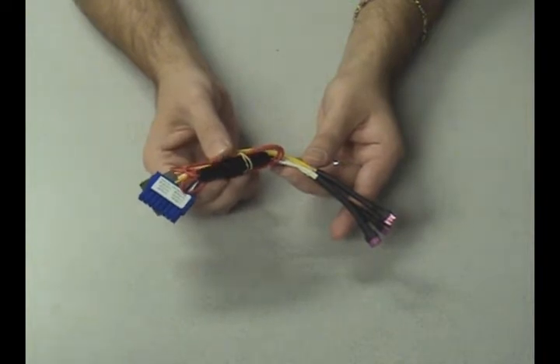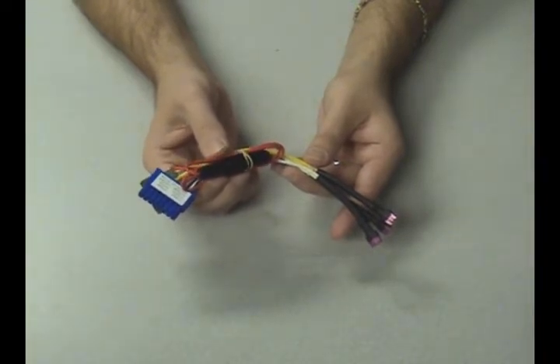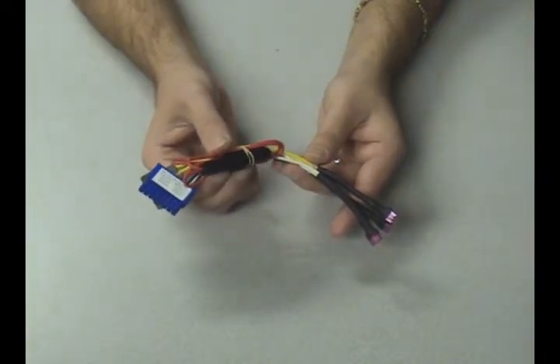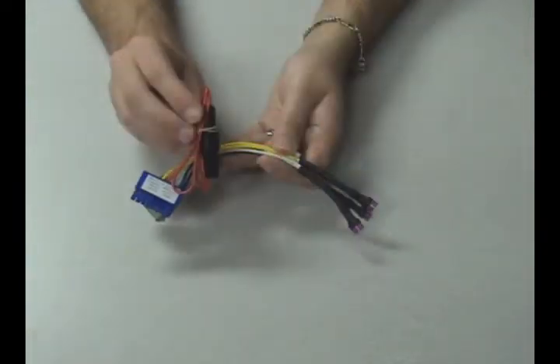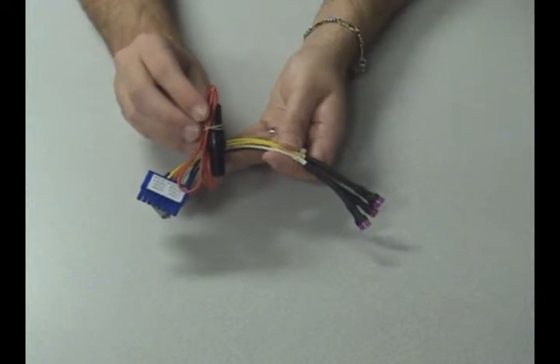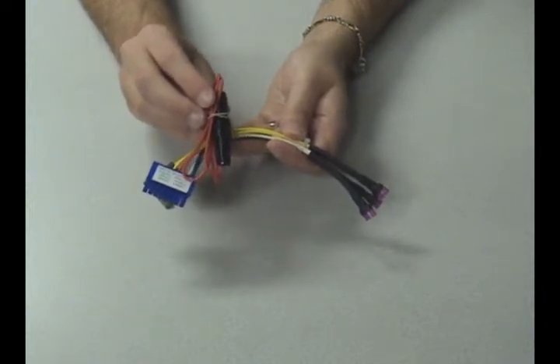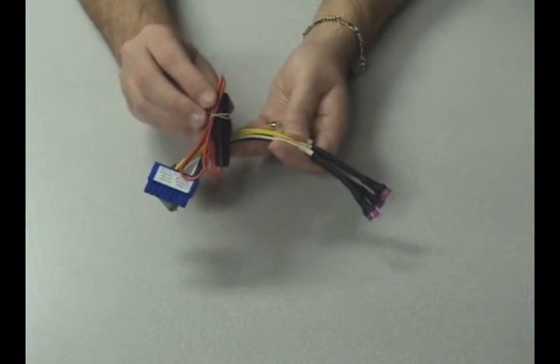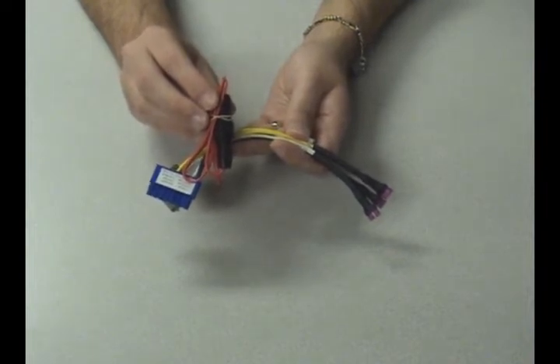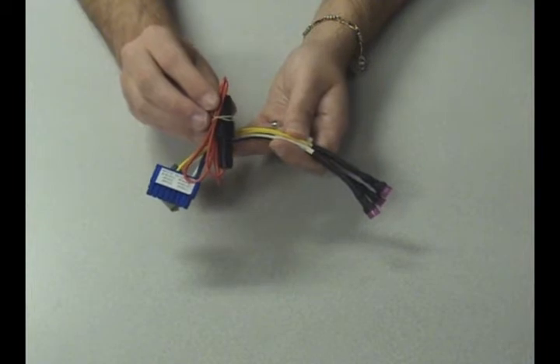To protect your VZ7 and any motor or circuit that it's connected to from accidental damage, never replace this fuse with anything greater than one amp. Also, never connect the clip at the end of this wire to, or allow it to accidentally touch, anything besides 24 volts AC. The circuit board on your VZ7 will be instantly damaged if connected to a higher voltage. Your warranty will not cover damage of this type.